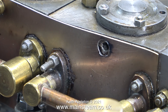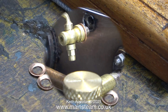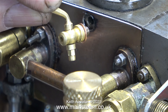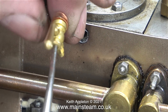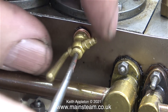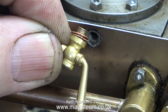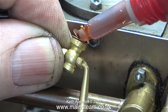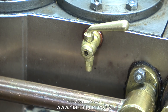The holes in the cladding are a bit strange — they're actually too big and not quite in the right place — so I'm going to use some shim washers. For this first drain tap I had to use two shim washers. Here's a very useful tip: use your scriber point to hold them in the right position so you can rotate them to screw them into the hole. It's surprisingly difficult to hold them just with your fingers. Both shim washers are a different thickness, but together they're just right to allow the part to end up in the right position.